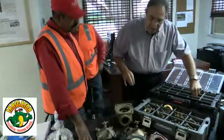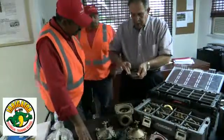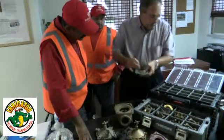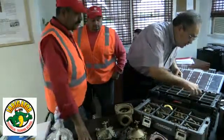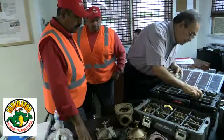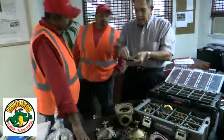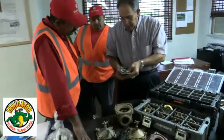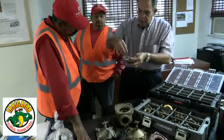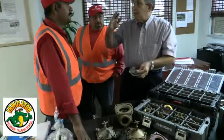Now the other part is that when the valve closes down, we're pushing water all the way on top of this area but we're also pushing water back through the center of the diaphragm assembly. As that water pushes down, it goes the opposite way — so instead of water coming up, it starts going the opposite way and we push water through the center of the pin bearing. That's how we get our closing speed.